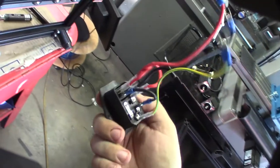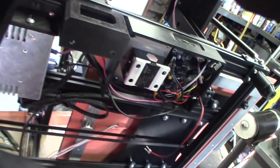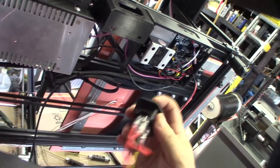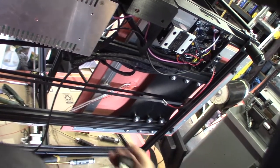This is a double-pole switch right here, so it basically shuts off both the neutral and the hot. Most of these printers actually come with a single-pole switch that would only shut off the hot wire. You don't want a hot neutral coming up to your bed. When your bed stays plugged in you don't want that neutral wire live, because if your house is miswired or some device is having issues, power can back-feed.